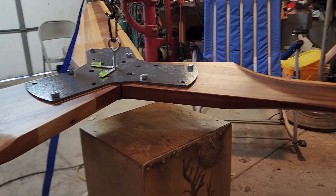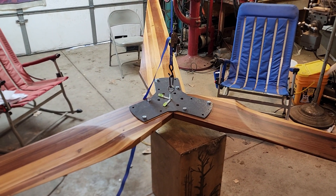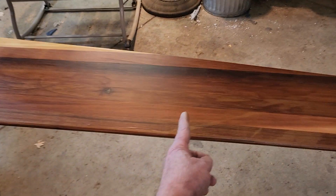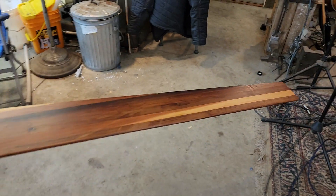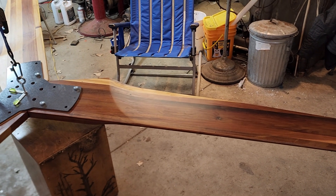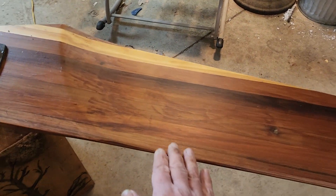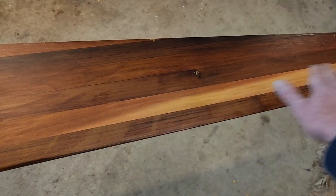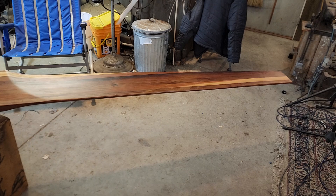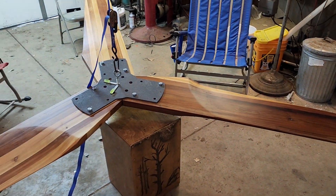It's only an inch and a half thick, and some people freak out about that, but I have no problem with blades like this starting up in low wind speed. If you consider that power is related directly to the swept area, then we know that halfway out on the blade, 75% of the swept area is coming from the outer half of the radius. The inner part would be 25%, except that it's inherently less efficient anyway. So as we come in closer, I worry less about getting the correct angle of attack in here and quite a bit more about it out here.